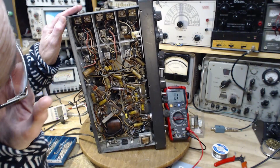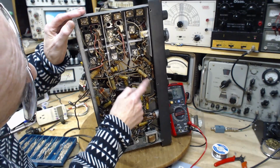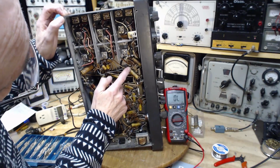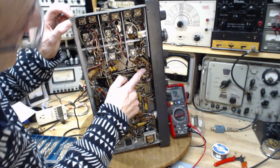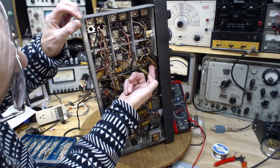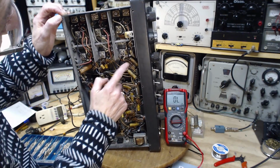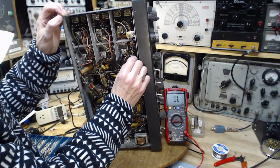Oh, capacitors. We have capacitors here. So this one's in the area, but it's really connected over this way, grounded here. This is the one with the sliding cover. I think while we're in the neighborhood, we should change this. This guy, there's a terminal strip tucked away in here. He should go too. Yeah, it is involved with this tube. So why don't we take a look for this one on the schematic, see what it is. There's a mica one up in behind there, which I would tend to leave myself, unless there's some clear reason for going at it.